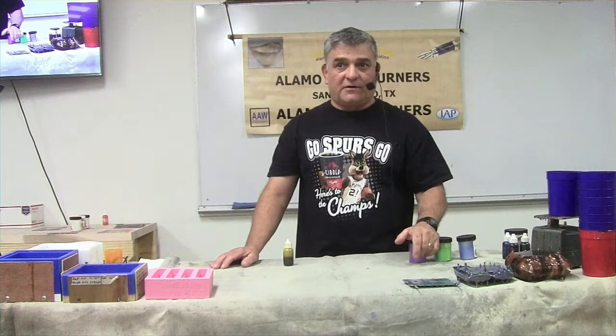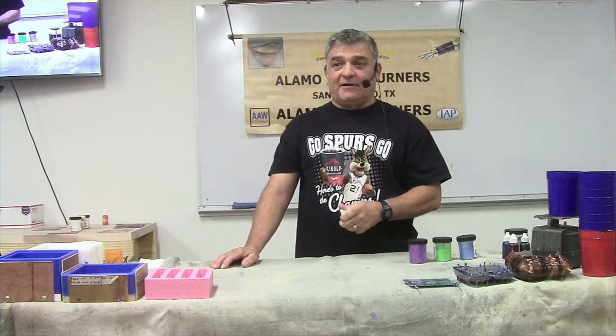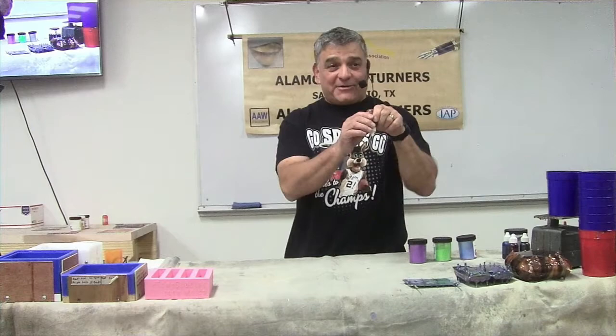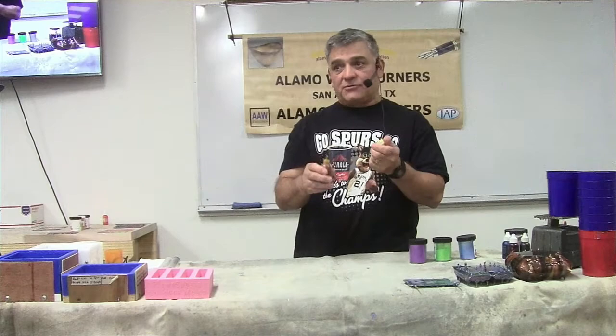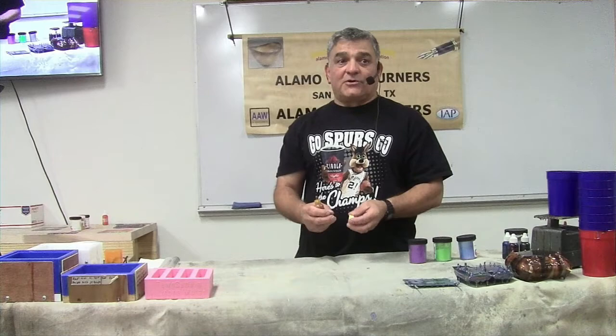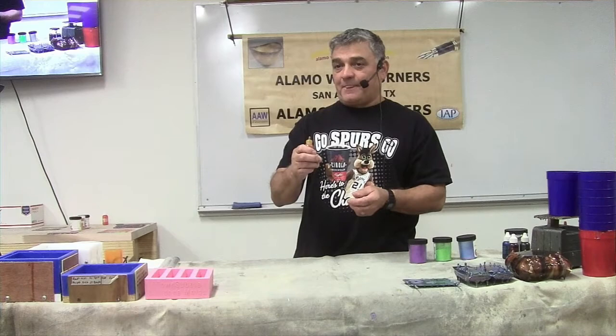For Alumilite dye, I use 10 drops per ounce. For a 34-ounce block your forearm is going to get tired so switch to the other hand. The key is to take good notes. For my dye bottles, every time I refill or get a new bottle I reuse the same tip - if you use a new tip every time you'll have a new hole and the drop will be a different size. By using the same tip for the same color every time, I consistently get the same drop size.